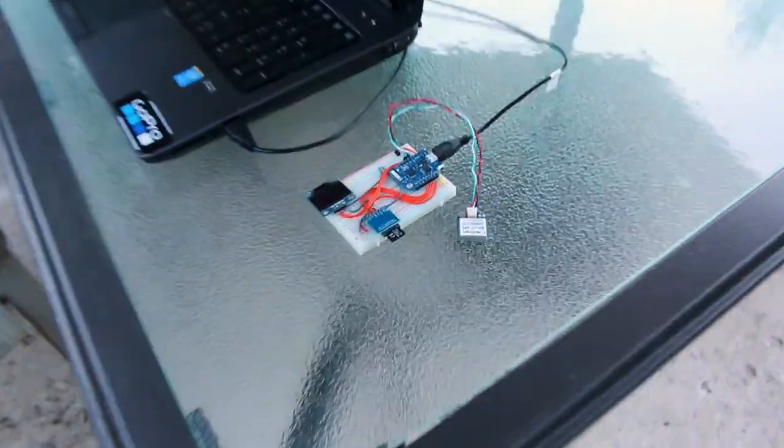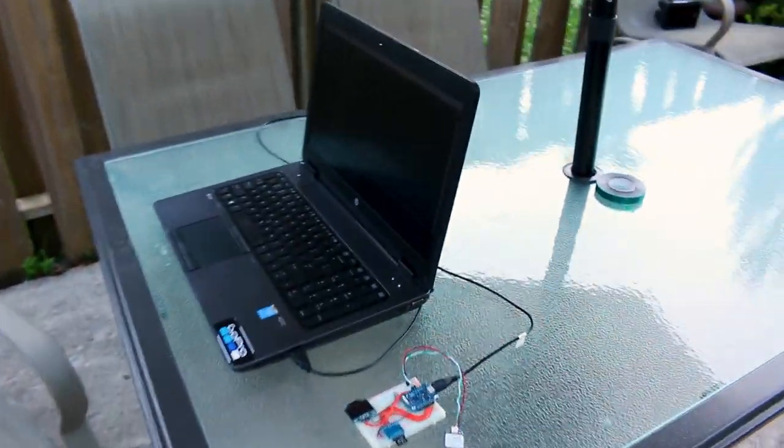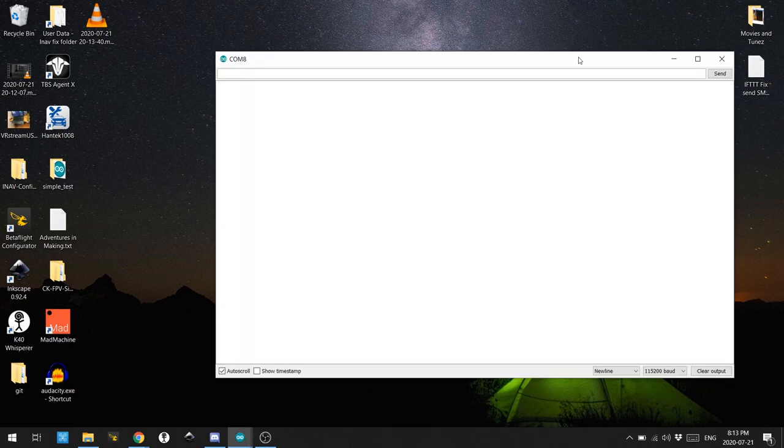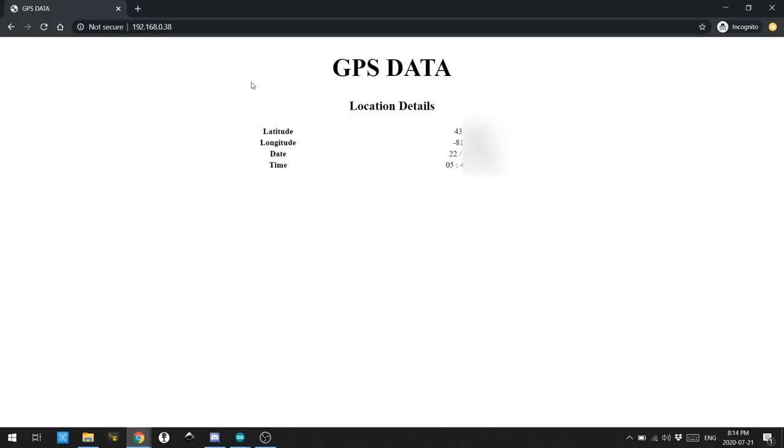At this stage I'm just going to test the GPS. What I do with my code as usual is break it out and just run the GPS example to see whether it would work, and sure enough I was able to get the ESP8266 to set itself up as a web page on my local network and display my current GPS location and the UTC time - exactly what I needed. Now I know we can go ahead and integrate it into the existing code, as long as we don't run into memory issues like I did when I put the OLED in. This project is looking promising.